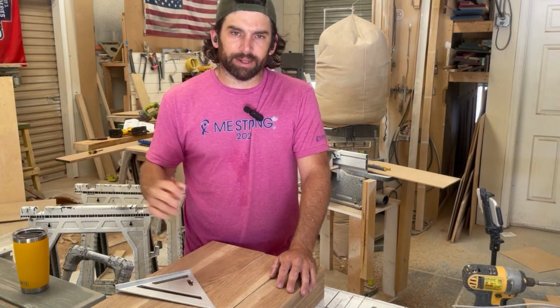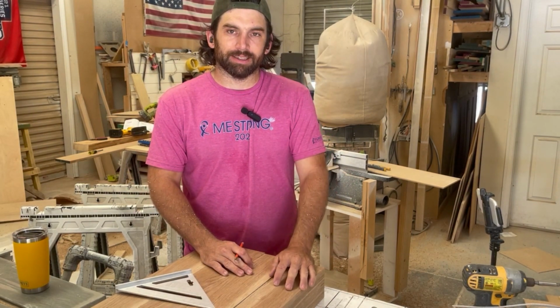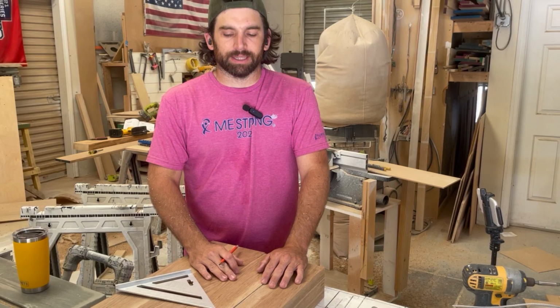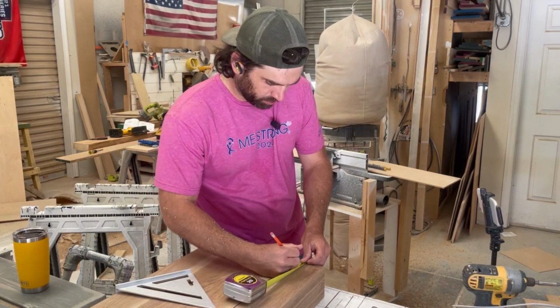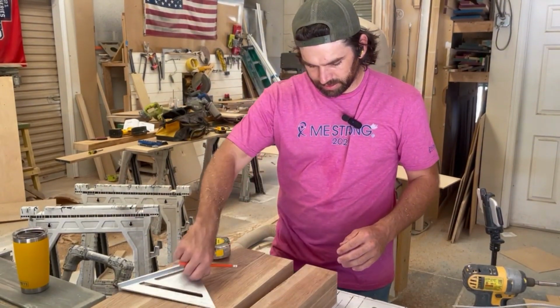So I know that my countertop right there is 3/4 of an inch. I'm going to go ahead and do about an inch depth for that thing to sit on. We'll get these pieces cut out, and then the countertop, we can trace that and make sure we get that piece on there. So we're going to give it that extra 1/4 of an inch. We'll have this sit on the inside.